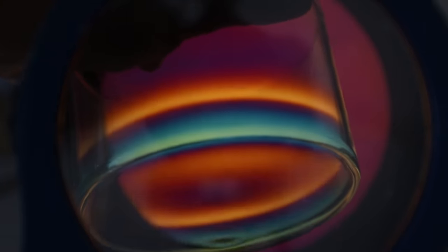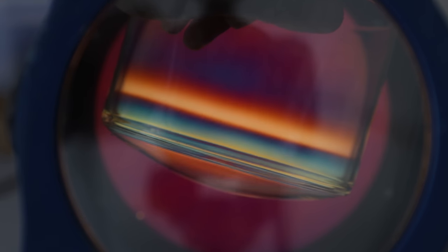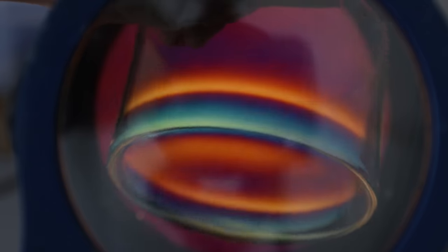So normally we should put this glass into an oven, but we won't be able to do this with our tube because it will contain getters and other sensitive parts which would get saturated or damaged with high temperature. So we will have to find a way how to seal the window glass into the envelope and flame anneal it while it's still on the lathe without using an oven.